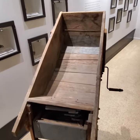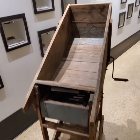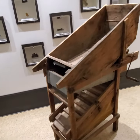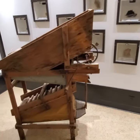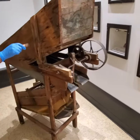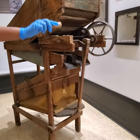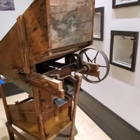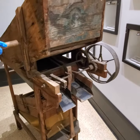What one would do is put dirt, sediment, and rocks in this top layer, and then it would flow through the rest of the machine. How you would operate this is somebody would use this crank wheel and turn the handle, which would then operate the whole tool, utilizing the canvas bellows below at the bottom of the machine, and shifting this tray back and forth to separate loose dirt from any heavy gold.